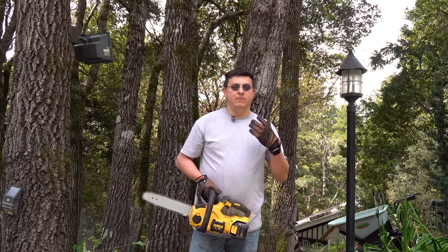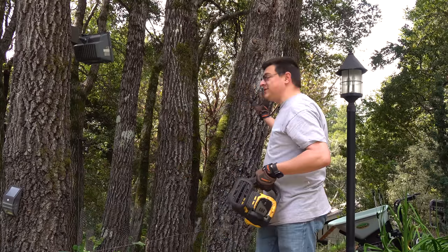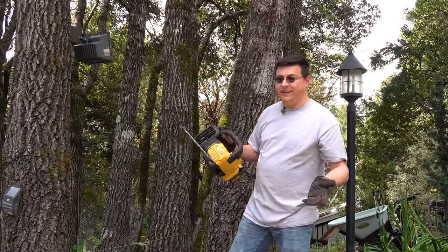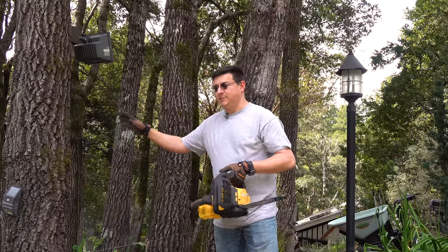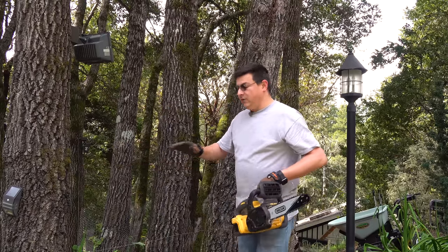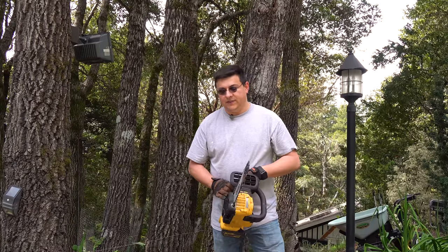The reality is that for most tasks, a 12 inch bar is actually just fine. For instance, these oak trees right back here — I could actually cut one of these down with a 12 inch bar if I needed to. It's not ideal for these particular trees because they're just a bit wider than that at breast height, and if you were to cut right down to the bottom you would need the longer bar on that 357.